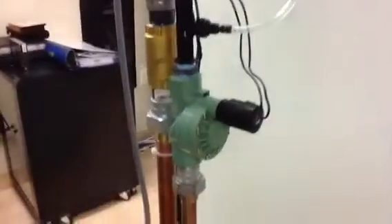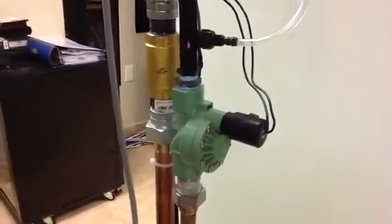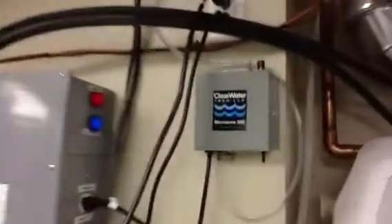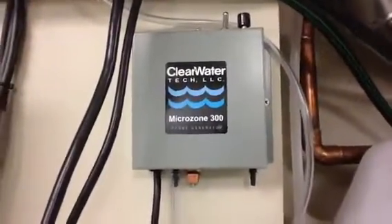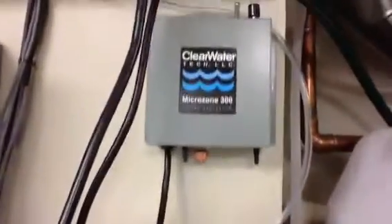This here is an ozone loop for simply sanitizing the tank every night. In the middle of the night, for five minutes, the solenoid valve opens and we use ozone to sanitize the storage tank. Very little ozone is needed. For other applications, we'd size it accordingly.